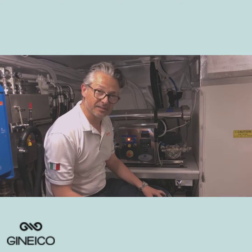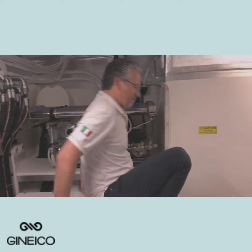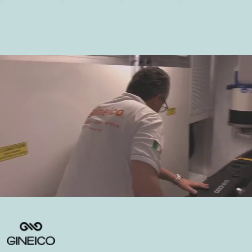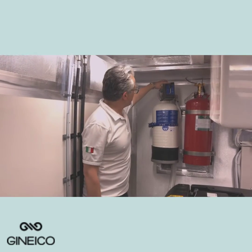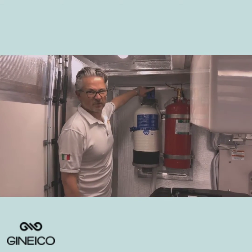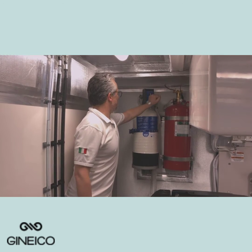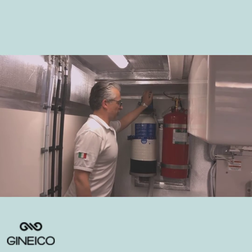The interesting thing about this machine today is that it is fitted with a sand filter. I wanted to show you quickly what happens with our sand filters — this one is over here. The sand filter is fitted with a switch. At the moment it is in production. The next setting all the way down is flush, the one above it is rinse, and then it's back to production.